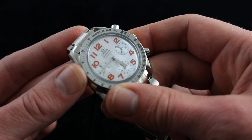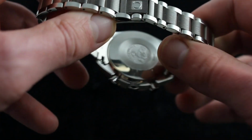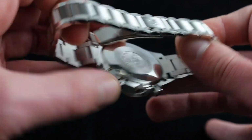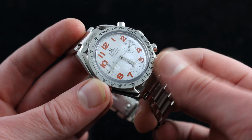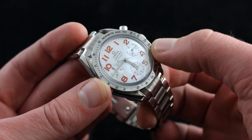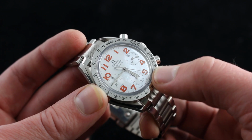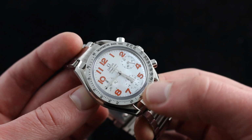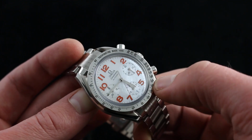You'll also notice that the caliber 3220 alpha is a solid case back, so there's nothing to see but the traditional hippocampus or seahorse. But this caliber features a vertical clutch engagement, something that the original Moonwatch, the definitive Speedmaster by some, does not include. So you're safe to run this chronograph full time and use the chronograph seconds hand as center seconds, whereas on the Speedmaster Professional, you really should limit chronograph exposure to a few hours in order to reduce wear and tear on the chronograph drivetrain. Not so here. This gives you flexibility.